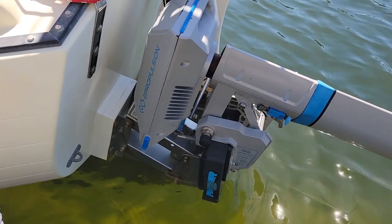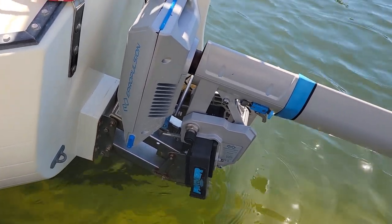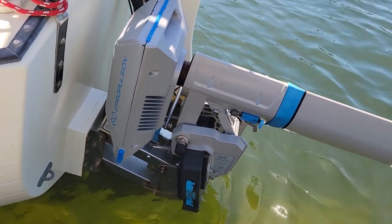If you notice the motor mounting on Kahuna 6 — because the rudder sits naturally on the centerline — I have the motor offset to the port side. That gives me an exaggerated prop walk whenever I use the motor, particularly in reverse, where the bow really wants to swing to port. I use that to my advantage when docking: just a little reverse power moves my bow to port. To go straight back, I have to put the rudder hard over to counterbalance the prop walk. It's a blessing and a curse, but once you learn it, you can use it to your advantage.